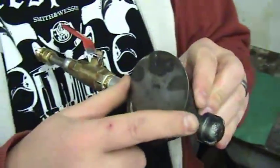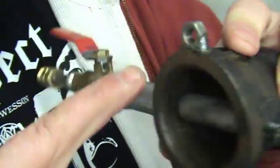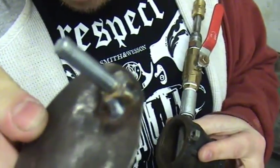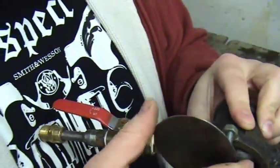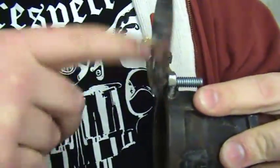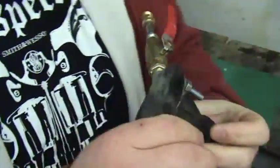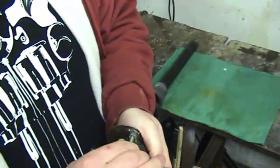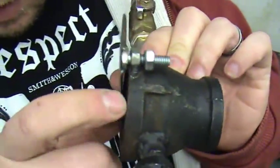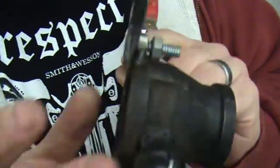I also made a little carburetor on the back of this, and I find it works good for me. What I did was weld a nut up on top, then made a little plate out of plate steel and welded a bolt onto it — that just basically threads in. Depending on how close I screw it in, it limits how much air gets sucked into the reducer. I also put a bolt on the other side so I can have it locked in place and it'll stay up there.